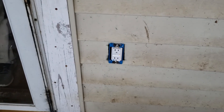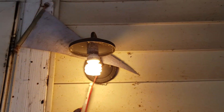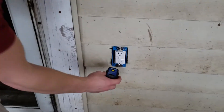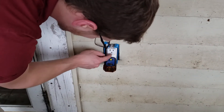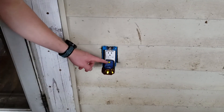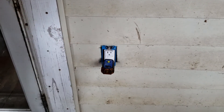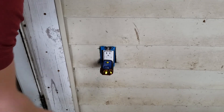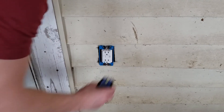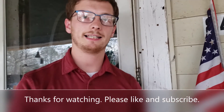There's a light on my switch — look at how fancy, the light still works. We're going to test it. We hit reset on there and we've got 124 volts, correct wiring. I'm going to test out the ground fault — it blew it, that's good, that's perfect. We'll go ahead and test this top one out. There we go. So all that's left on this one is put the faceplate on and put everything back in — that's a job well done. Good job Dylan, thank you for your help.